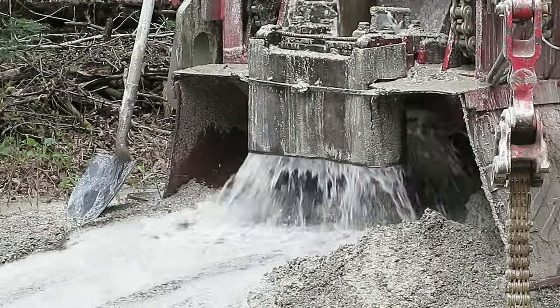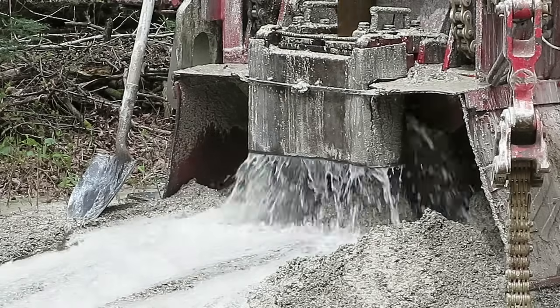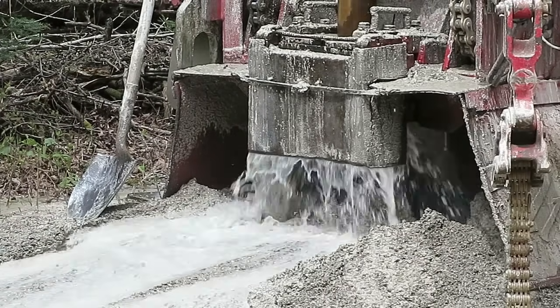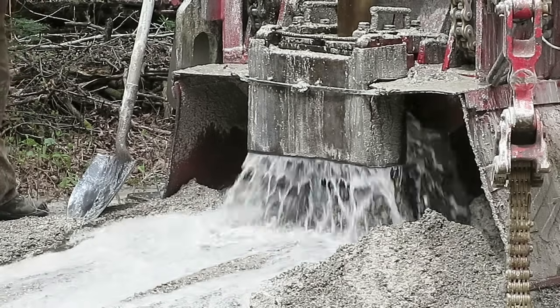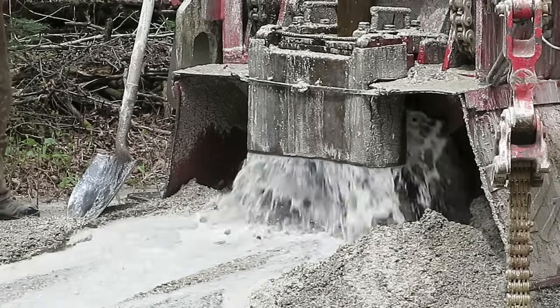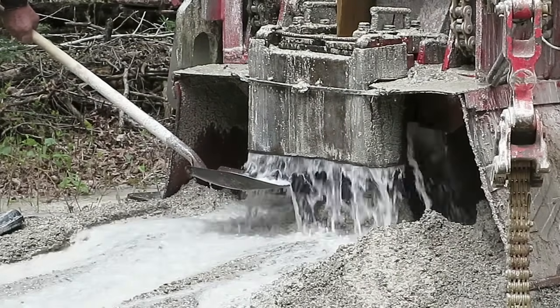The question now remains — how much farther do you keep drilling? We've clearly hit good water, and we want to go down far enough to make sure we really do have some good stuff in large enough quantities. But it is possible to drill too far. Sometimes if you keep drilling too much you'll open up an empty rock crack or fissure, and then all your water will start flowing down and you won't have any in your well at all.